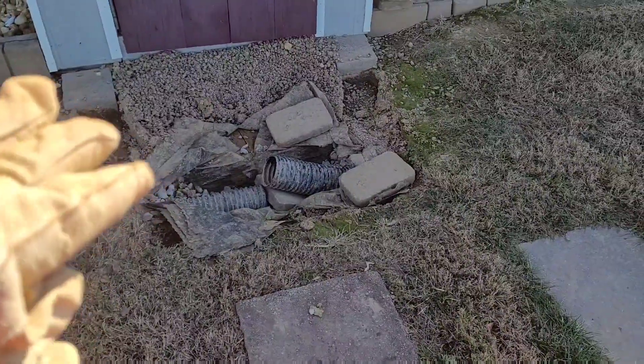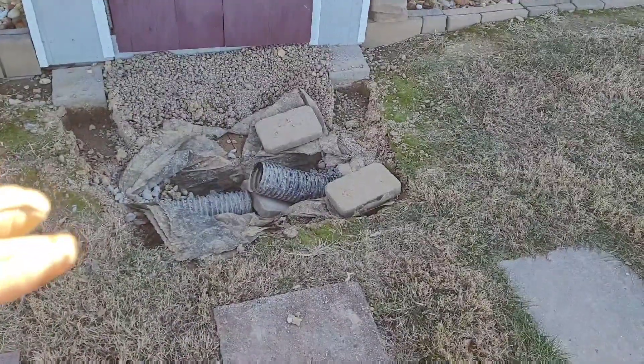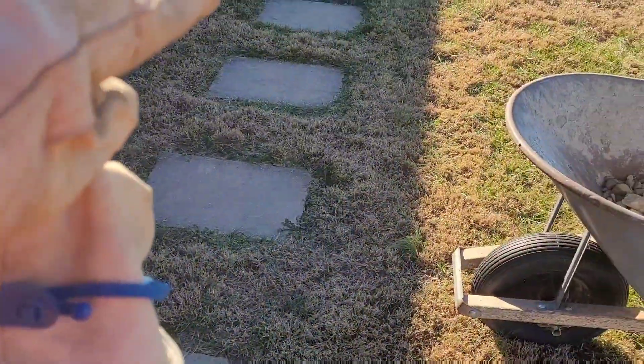Where Ricky's sniffing around, that's the high point of the drain. I cut that and I'm going to put in a catch basin there. That catch basin is going to gather more of the water at this low point — the pipe is the high point, the ground is the low point. It takes more of the water that way and more of the water this way.